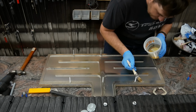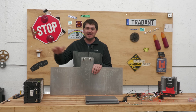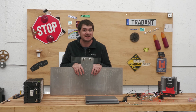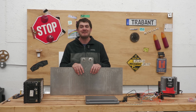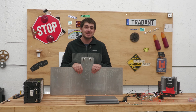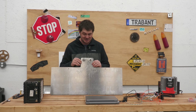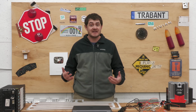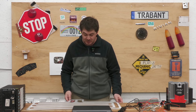I put together one as a test. That wasn't enough testing, and then I just went ahead and bought all the supplies and built all 6 of the cooling plates. Here's one of them, and they're assembled with epoxy, and just like so many of you predicted, they leaked. All but 2 of them leaked with just the tiniest amount of air pressure. So these are worthless. I did design a new cooling plate to be held together with rivets instead of epoxy, and I redesigned the cooling path.